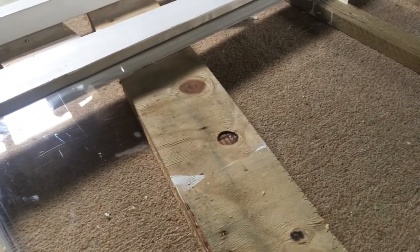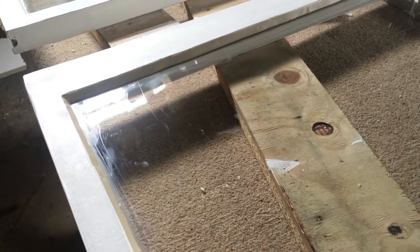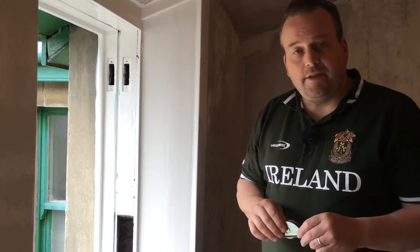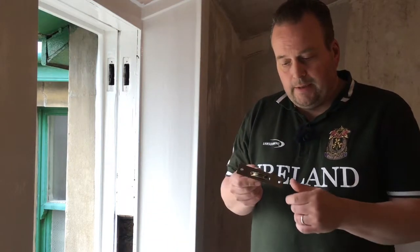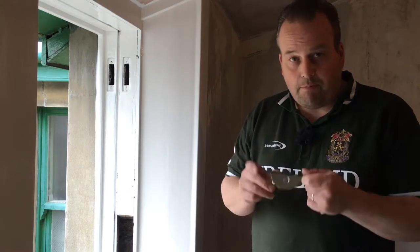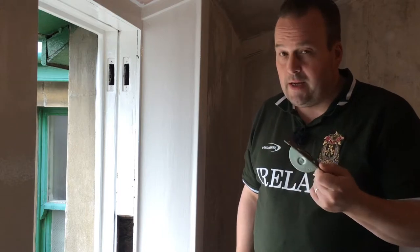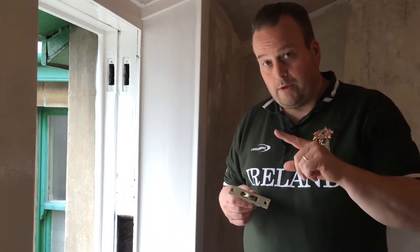Because of the putty, we now have to wait for a skin to form before we can paint it — it can take a week or more for the skin to form. In the meantime I'm going to put a second layer of gloss coat on the window surround. The window surround has now been finished — two coats of top paint, so it's ready for the fittings to go back on. I'm going to do the pulleys, and for this job I'm using Miton pulleys — a really very good quality pulley. It's worth paying a little bit more to get a good quality product here, because you're only going to be doing this job once.